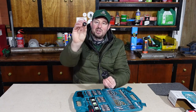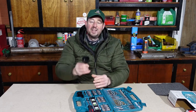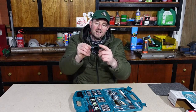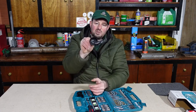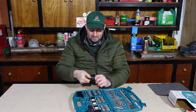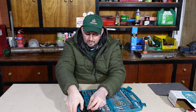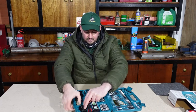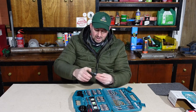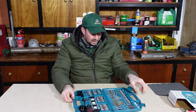We lock it down on there, then put the nut back on behind it — the nut has a hollow side and the hollow side goes down, clamping it up onto there. You've already drilled your pilot hole with a smaller wood bit, then you put this in the centre of the pilot hole, go in nice and steadily, and the hole saw will catch on the outside. Take it nice and easy, go through and pull out — you should get a nice disc and a decent hole. I'll put these away because if you don't, you soon end up with bits missing. We've got loads of cases with half the stuff missing — normally the 10mm sockets and Pozi 2 drives go first.